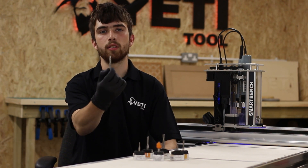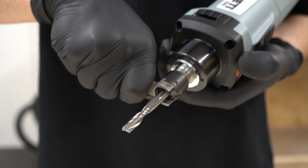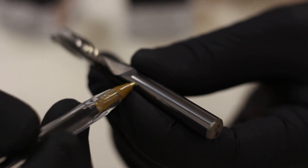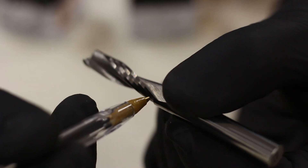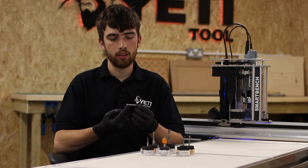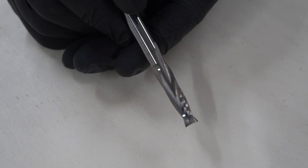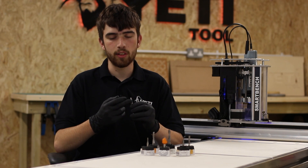Routing is a process where a rotary cutter removes material in a sideways action. In SmartBench's case the cutter is mounted in the spindle motor which is then fitted into the Z-head. So let's understand the basic terminology and parts of a cutter. You have the shank, the body, the flute and the cutting edge. The shank is what the collet clamps onto to hold the tool in place. The body is simply the area of the tool that has the features on it. The flutes serve to evacuate chips from the cut, and the cutting edge obviously does the brunt of the work.